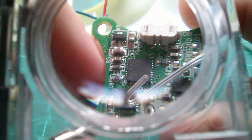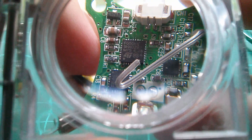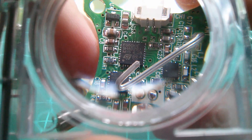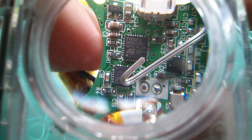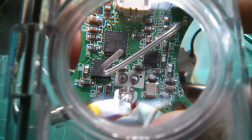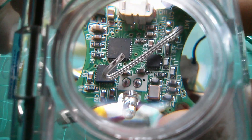The big chip looks like it's an ST microcontroller — it's definitely ST, and it's an F050K4, I think that is. So yeah, that would be an ST microcontroller. Now the antenna runs up to that top right hand corner. Does that give us a clue as to what the other chips are? I'm going to have to move that wire anyway, so let's do that now.